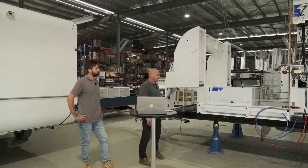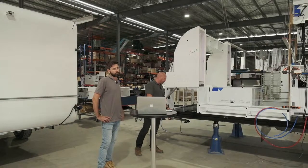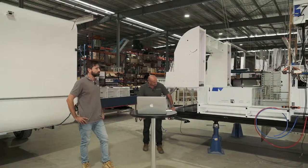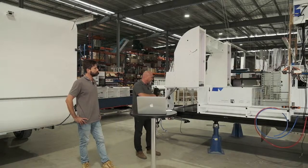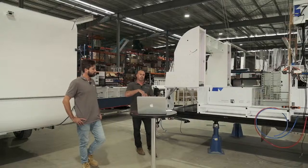I see David Britton's here asking us about the urethane glue. Yeah, it's a marine grade urethane that we do use. And that's part of our bonding into our extrusion. For example, we have ribs in here. The reason we have ribs in the extrusion is that when you put a flat surface into another surface, like into an extrusion, we have to put the ribs inside there to allow for the glue to stay in there, because otherwise you push the glue straight out, just sheer force.